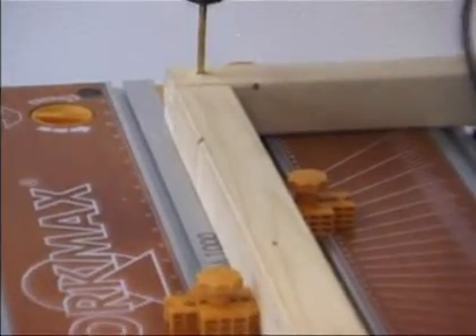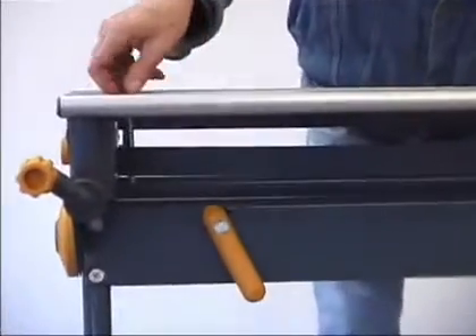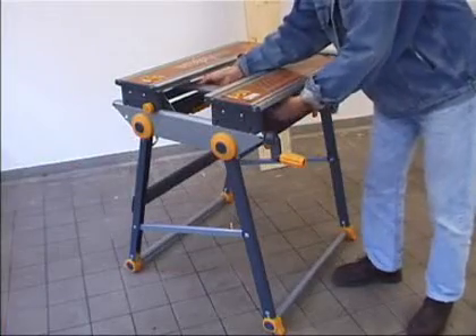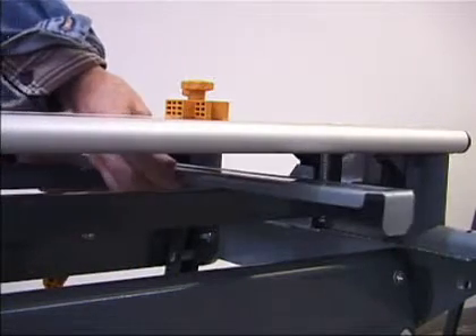The third unique feature is the up clamp. Two knobs on each jaw may be turned to raise or lower a clamping bar underneath the jaw. This bar may be used to clamp a workpiece up to the underside of the jaw, or as shown here it may hold two helping hand supports which span from one jaw to another.